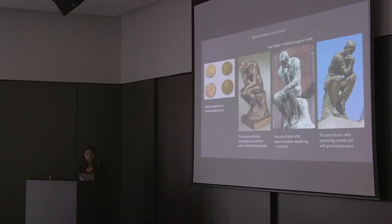To understand artificial patination, it's useful to look at the natural colouration of bronze first. Bronze is an alloy of copper and produces a range of coloured compounds when it reacts with the environment. Brown and green are the most common colours. Brown forms first, like the penny on the left, then bronze turns green after longer exposure to water and oxygen. These images of Rodin's Kiss show the progression of a sculpture outdoors — it may start with the traditional brown finish, but after many decades without maintenance, it will look more like the one in the centre. The image on the right shows the contrast with a well-maintained sculpture that has aged more gracefully.